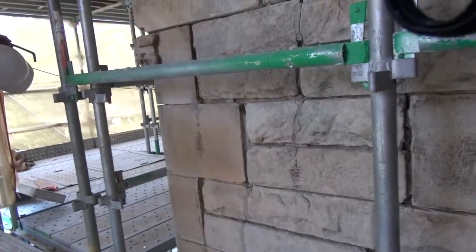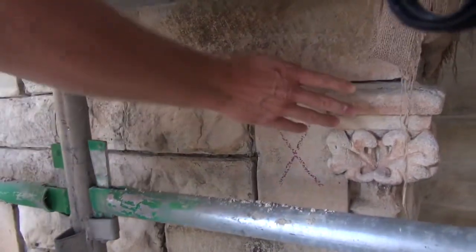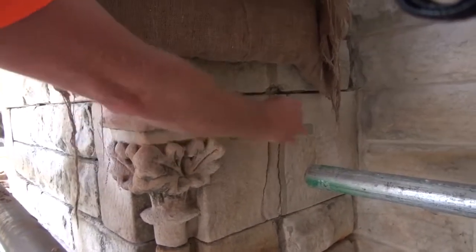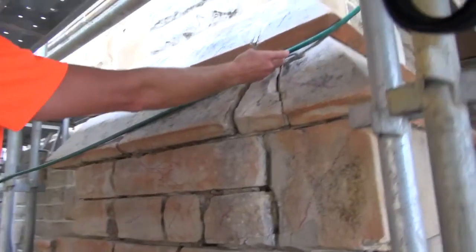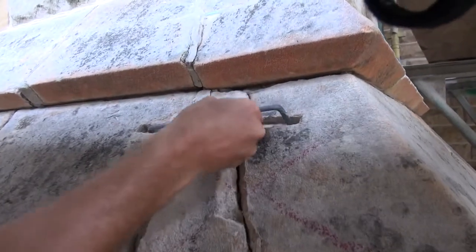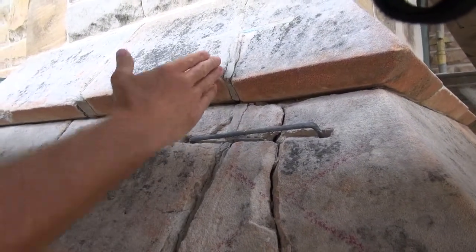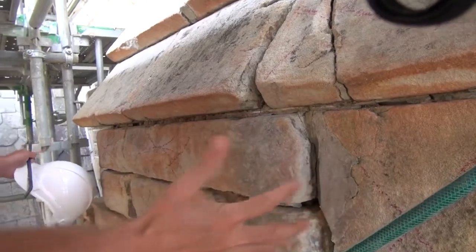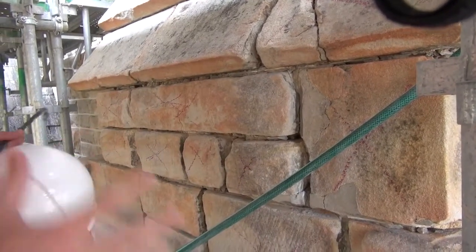If you see this profile shot, the X's we've marked are stones to be replaced — they've failed. This one on the side has cracked vertically, been previously pinned and has still cracked twice, so that stone has failed. On the side of the south east buttress, again you can see pinning details that have been installed and failed — the pins are too shallow and not bedded down enough. The stones are all moving to the east and moving out. This section of the buttress has bellied and the stones here are very soft, extremely soft, cracking and failing as well as the entire buttress.